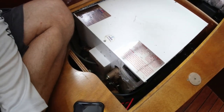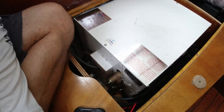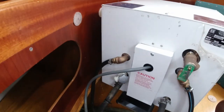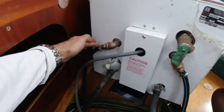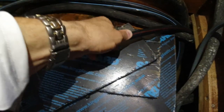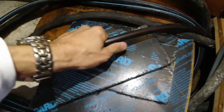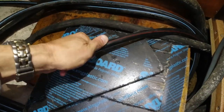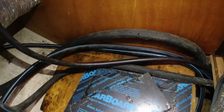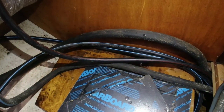Typical boat stuff. Found the leak — the hot line coming out of the water heater was pinched, and in the bottom of it there's a split which you can't really tell when there's no water pressure on. But as soon as you turn it on you see dripping and hear air hissing as it's trying to refill the tank. What I need to do is cut this and put a splice in there.